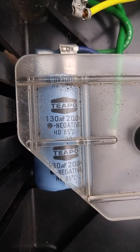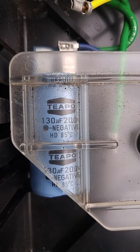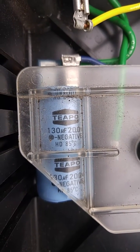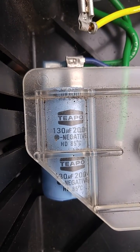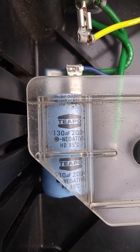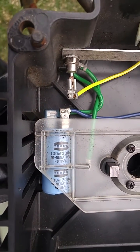Which looks like it's one of those — 130 microfarad, 200 volts. I'm thinking something like maybe a 250 or 200 volts or more could probably go in there. I think 200 volts is a little low, but I'll read up on that to verify — it seems like it might be a little low.